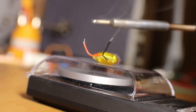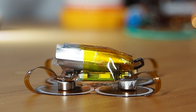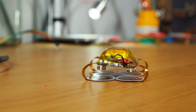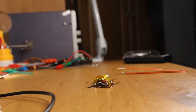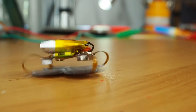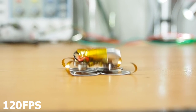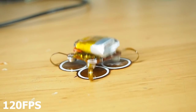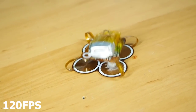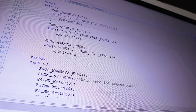By removing the connector and soldering the battery directly, the weight only reduced by a couple of hundred milligrams. I then tried playing around with different frequencies hoping to generate more energy per bounce, and it definitely made it more energetic. I kept changing the frequency until I found the resonant zone. The frequency could only be tuned in steps of 10 milliseconds, so I decided to open the robot and modify the software to find a better resonant frequency, also fixing some other bugs I found during testing.